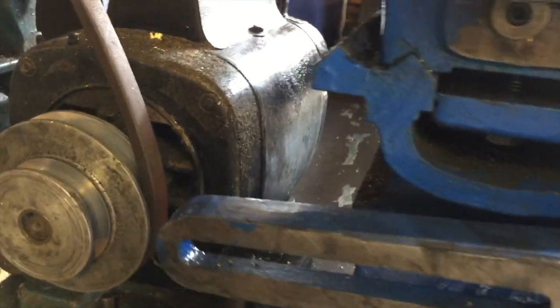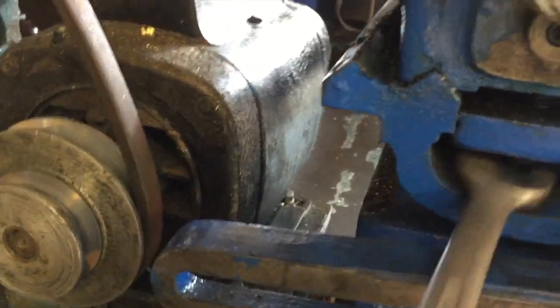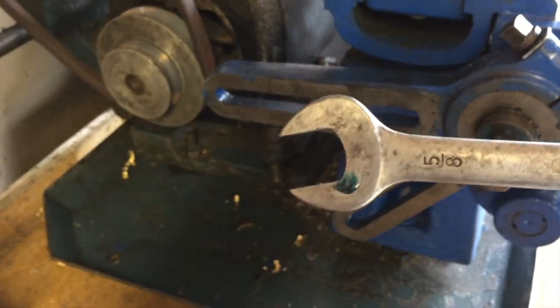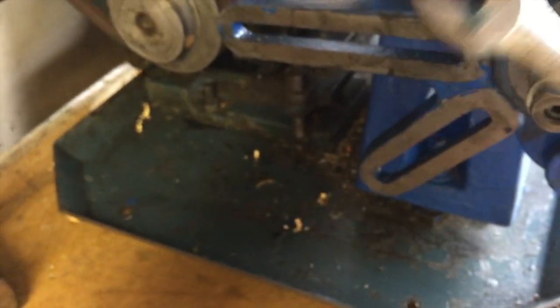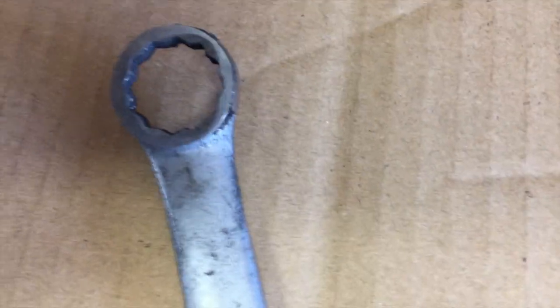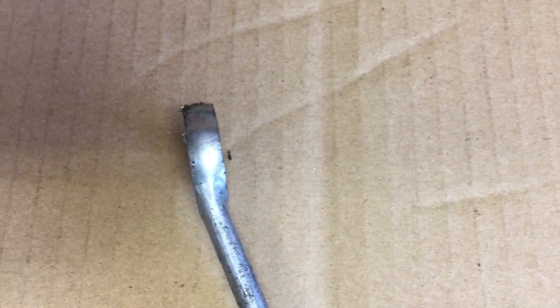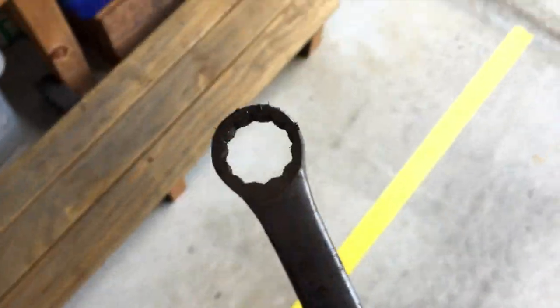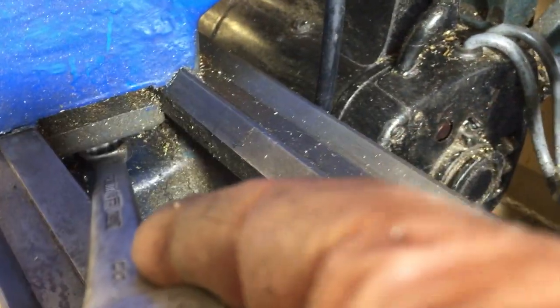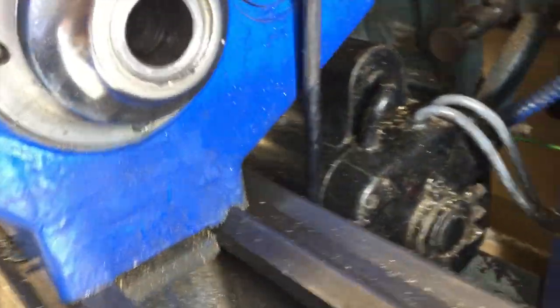This is the other end of the head, connected to the bed the same way with a plate. It's easy to find a spanner that fits this end first. I found that this 5/8-inch spanner fits the nut perfectly. Removing the screw that's underneath the clamping plate on the head is very difficult — I couldn't get the spanner to grip. So I decided I had to grind the ring spanner down two or three millimeters thinner so I could get it into the space underneath the head and loosen it. I just had to loosen it about an eighth of a turn to make the clamp loose enough, and then I could move the whole head back and forth along the bed. The head will now come off, but I still have to remove the belt.